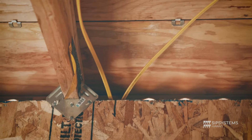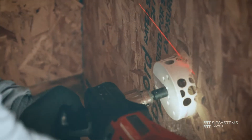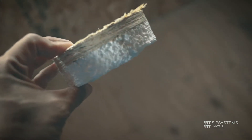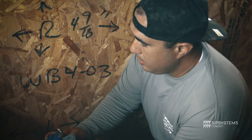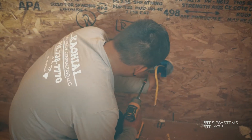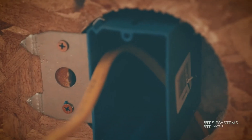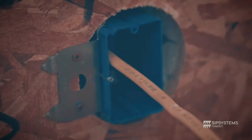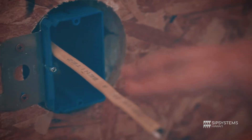What we did is just get our level mark, take a four-and-a-half inch hole saw, and drill it out. This is the piece that comes out. Then we're using these expandable boxes so that you've got your half inch coming out for your drywall, and that fits perfectly inside. That's the finished look right there. You've got four different entryways — you can come in from the bottom, the side, or going up, depending on where you drill your hole.